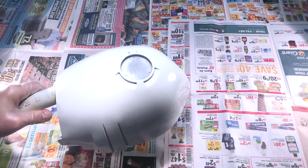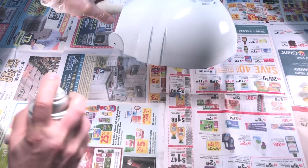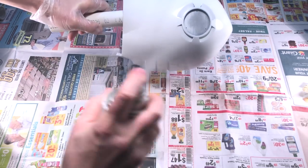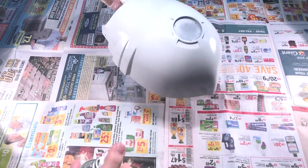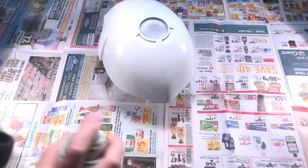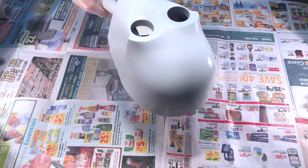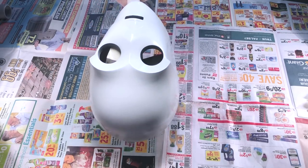Next, hit the items with some gloss clear spray enamel. Following the same steps as previous sprays, I sprayed a light first coat, waited 5 minutes, and then sprayed a second wetter coat, followed by a third wet coat. I had a fairly smooth gloss coat after this exercise. It wasn't mirror smooth, but smooth enough — we'll fix that in the next step.